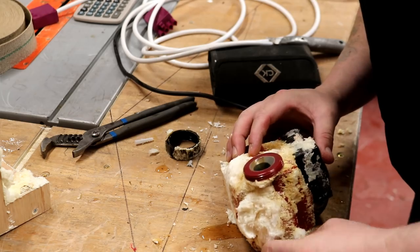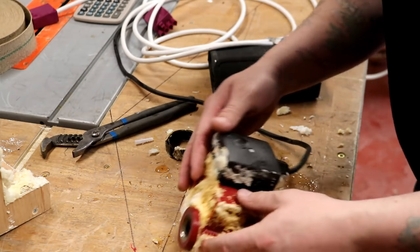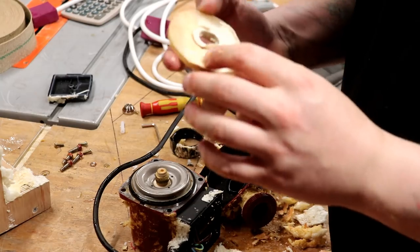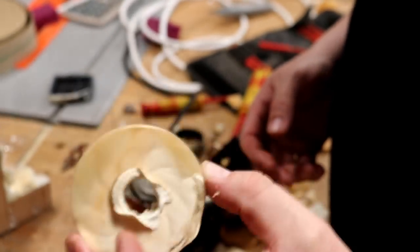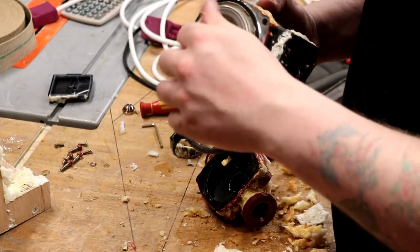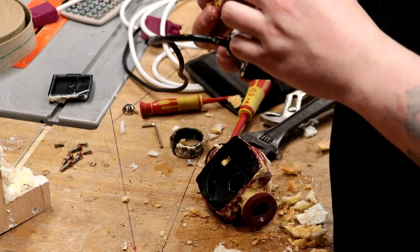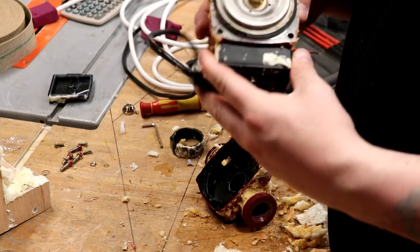Oh yeah. I can see in there that the impeller's melted. And we're in. I've just pulled this cover off, and immediately we can see impeller, heat damage, failure mode, broke, sheared, clean away from the motor, which seems to be in relatively good nick, if I'm honest. And